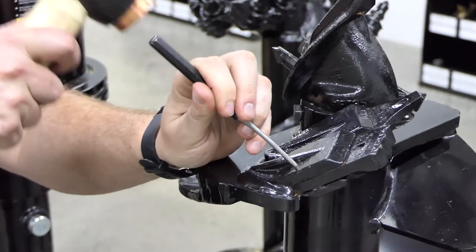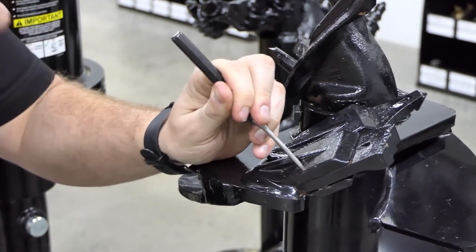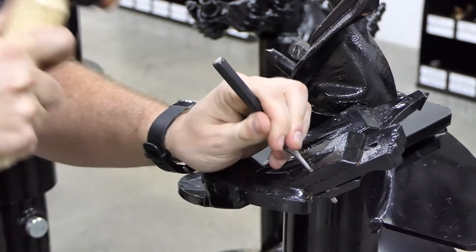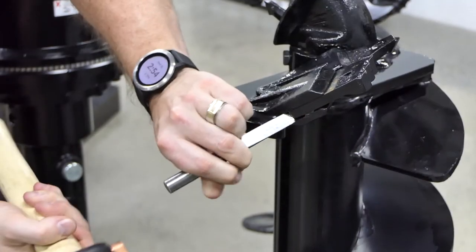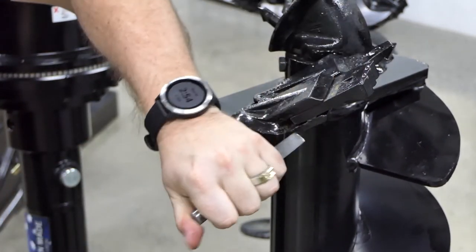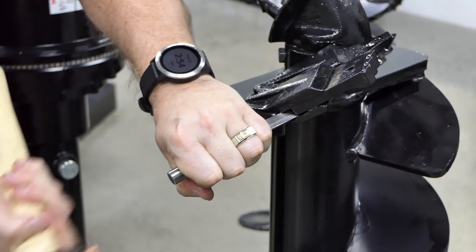Follow these first steps to remove them. If a pin lock was put into place, remove the nylon pin by using a hole puncher or by breaking the pin. Place a pin punch or center punch at the base of a tooth, then tap on the back of the punch with a hammer to dislodge the tooth.